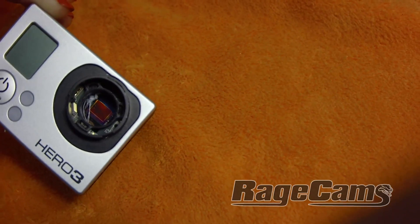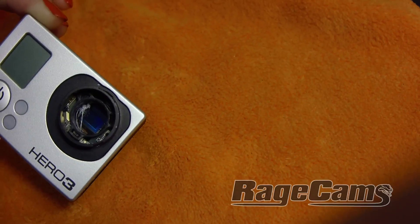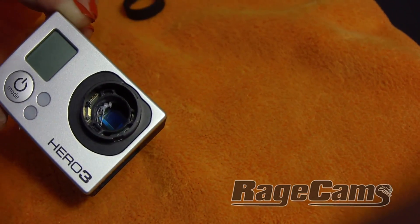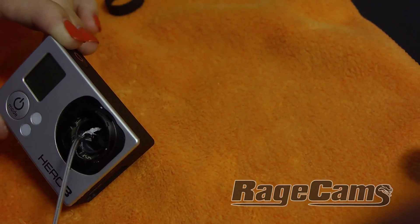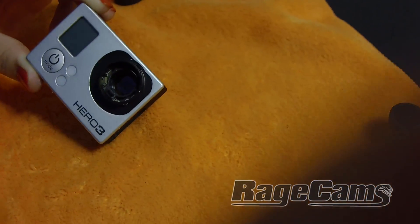You can see there is some leftover Teflon tape in there — take that out and make sure your sensor is nice and clear before you put in the new lens. Basically, you're just going to thread in your new lens and use an HD monitor to focus the lens.